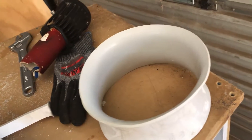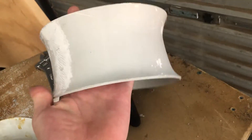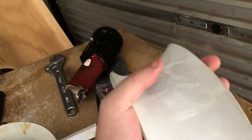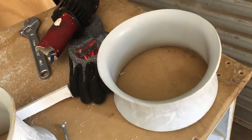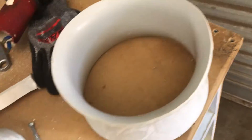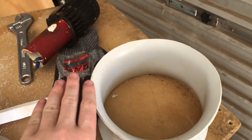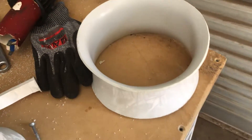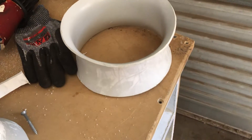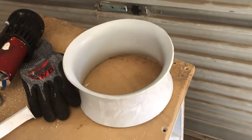That explains a bit about the impedance curve results I got. This one is decent from most angles, apart from that one spot which is really unfortunate. You can see there's a round over here — there's probably about four centimetres of flat in this ten centimetre port. Since it doesn't go to a complete round over flush with the enclosure, I'll just be mounting it a bit deeper in the lid and bogging up around it, then spray painting over it so it seamlessly flows into the port.